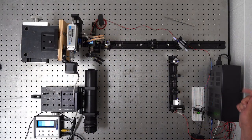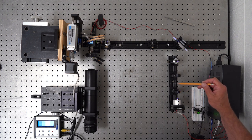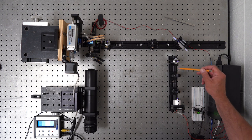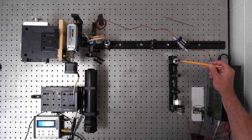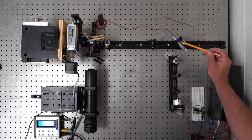Let's go over some of the parts. This is the laser operating at 405 nanometers. This is the first 25 millimeter lens, which focuses that laser down to a point right about here. That focal point becomes the focal point for this lens, which sends out a beam of parallel light — so the light in this region is parallel.